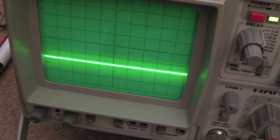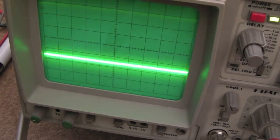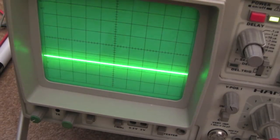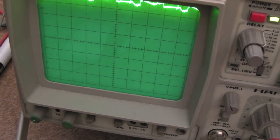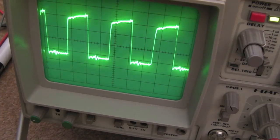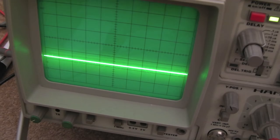I'll wind up the scope and have a look at the CPU. That's the reset — pressing Break makes the reset line go low, which is correct. The next pin down is a clock and it looks correct. The clocks all appear to be right. I can't see any issue with the video ULA or the CPU clocks.